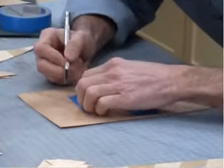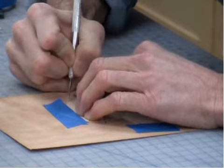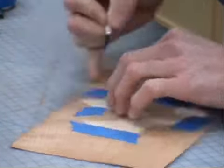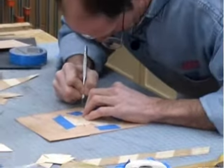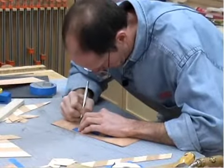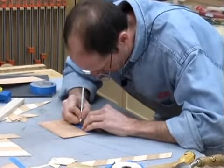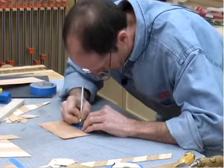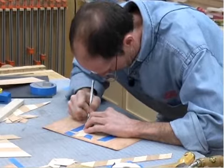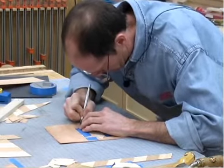I'll put my knife right up against the edge of my veneer and cut right through the masking tape, all the way around. I'm scoring at first, and I'll go through a second time and a third time if I need to. You want to be certain that you keep your knife up against the edge. If your knife cuts through the piece on top and the piece underneath, that's not a big deal because you're making a mirror cut in both and they'll fit perfectly. But if your knife pulls away from the edge, you'll end up with a gap. You can put your straight edge back on top and use it as your guide.